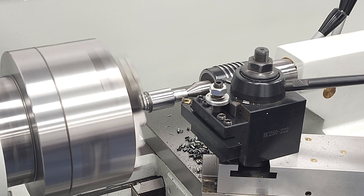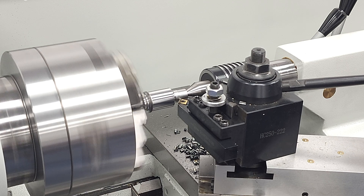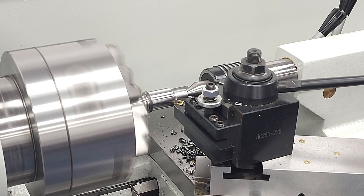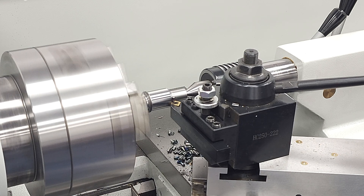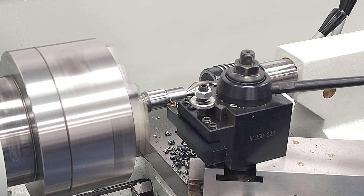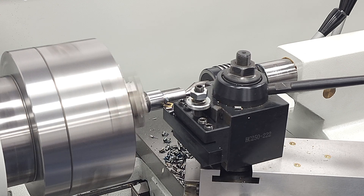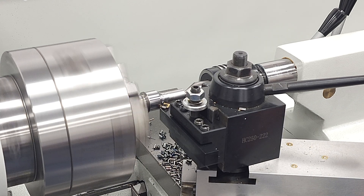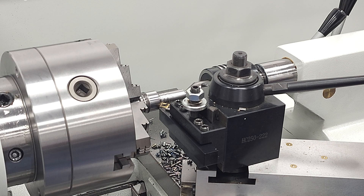This goes to show that you usually run out of rigidity before you run out of horsepower, and honestly there are things that can be done about that. I would bet that if we changed the general purpose tool out for something meant specifically for roughing and replaced the compound with a solid mount directly to the cross slide, we'd probably get this cut to work. And if you dealt with the chatter by selecting the right tool and stiffening the setup, you also don't have the hammering effect that causes the part to slip in the chuck. But before doing all that, ask yourself: why am I taking 400 thou off at a time when I could just take two passes, or buy the right size stock in the first place? Sometimes we're so busy wondering if we can, we forget to ask if we should. But I'm glad we gave it a shot to see what an obviously too-big cut looks like on this lathe.